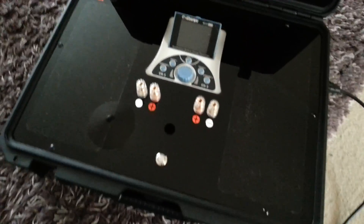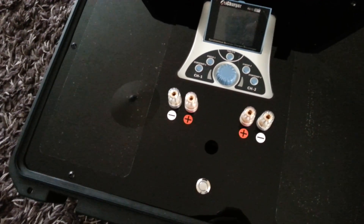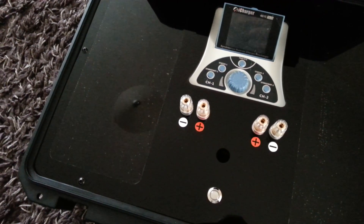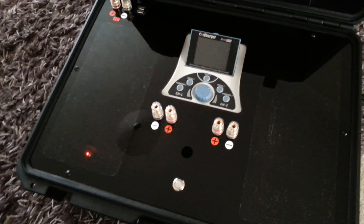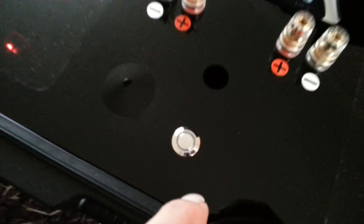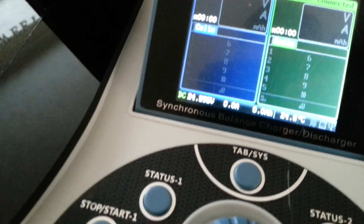Let's turn it on. Obviously I need to put power on the side with the switch. Turn it on. As you can see the little red light is flashing — that's the PSU controller main circuit board there. The red light would obviously in this instance signify that it's off, but it would also flash to signify there's been a fault with one of the power supplies as well, and something needs to be looked at. So in order to start the controllers, I then have to press this momentary button here. Let's press it. That starts the PSUs in motion and obviously starts giving an output voltage.